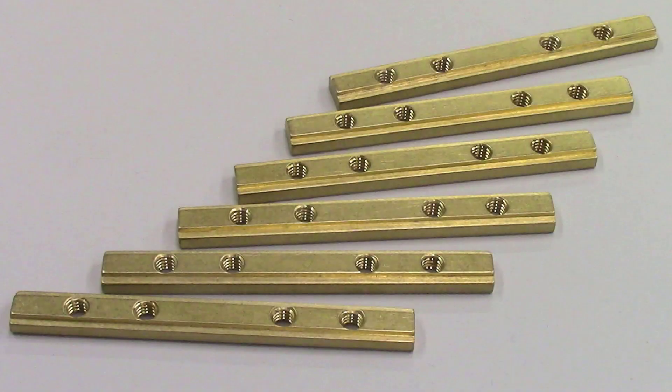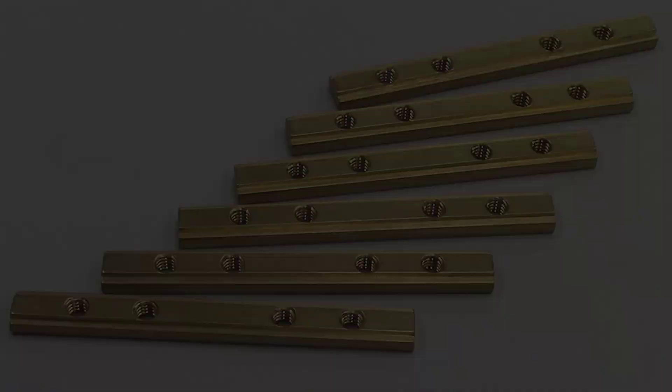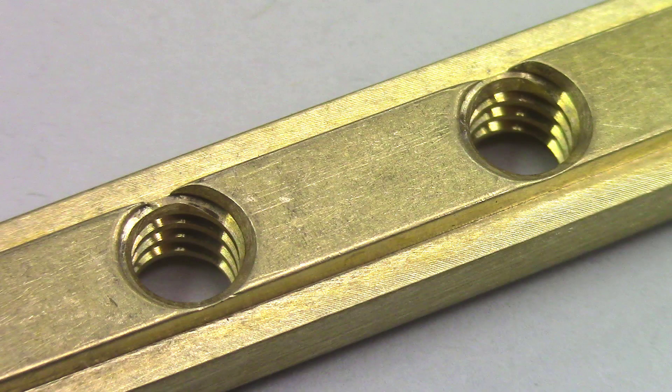After machining I took the pieces and ran them through a washing machine and tumbled them very slightly with a tumbler. This is what the finished thread looks like — here's a close-up of the machine thread made with the thread milling tap. You can see the nice clean sharp edges. You couldn't get a better thread using this technique.